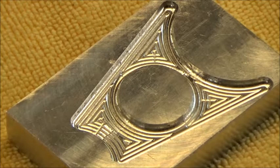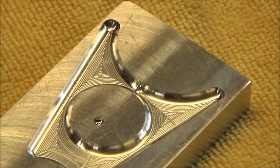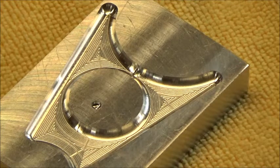On one side that's a 40% step-over with a ball end mill - the end mill size is the size I need for the radius around the edges of this alcove or inset. That's really rough - you can feel it and it would not look good. So on the other side, what I did was machine most of the way down using the 40% step-over to get through the project faster, then on the last cut I changed it to 1% step-over. That only took a few minutes longer and it's very fine - those little marks are only one thousandth of an inch deep.